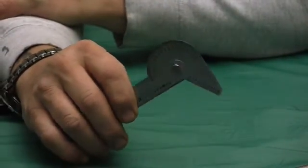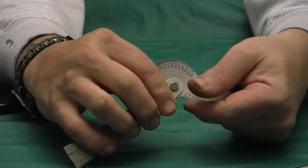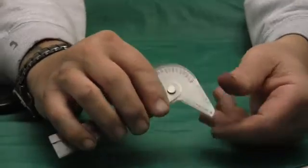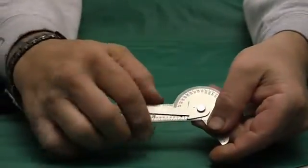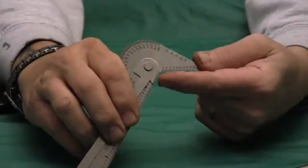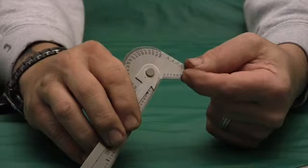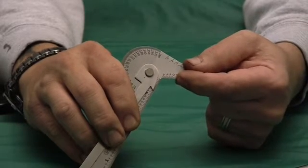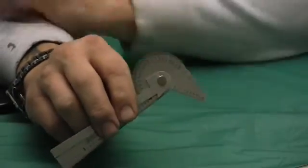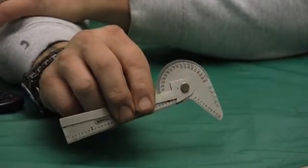You can get drill gauges that don't have all this. It's just a piece like this with the correct angle, which I think is 59 degrees or whatever, and there's a little ruler with the graduations. With a drill gauge, what you want when sharpening is something that has the correct angle for your drill point, and something to gauge so you know if you're cutting one flute longer than the other. Then you can adjust. I'll show you how to use this more when I get to the point where we grind drill bits by hand.